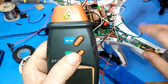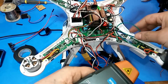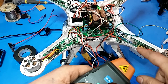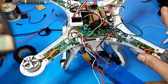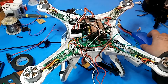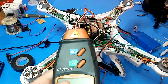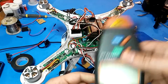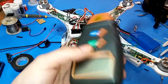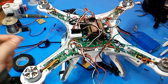The handy thing about this is - if you remember my video about the ESC firmware - I came up with a BLHeli firmware for this motor, and it was actually off. So I attached the programmer and reprogrammed it, and I have better settings for this motor now. I'll add that into the comments on that video. The key point for RPM readings is consistency - it doesn't matter how accurate the absolute number is, as long as it gives the same reading reliably every time.